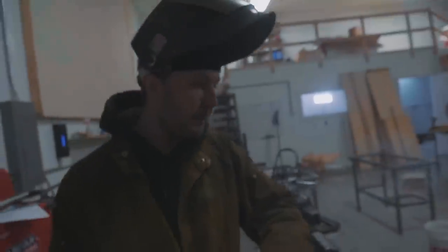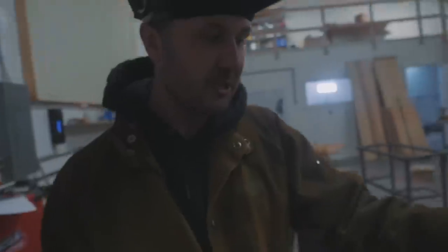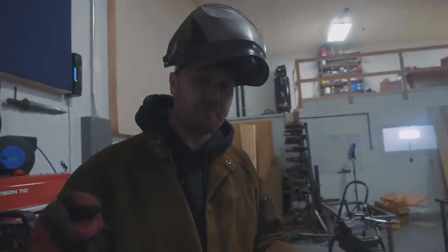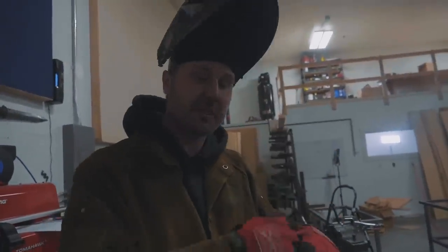There you go. Whoa, that's quiet. That is not sizzling bacon like I'm used to hearing. Yep, that's spray arc. And that was a quick weld as well. Super hot. That is beautiful, flat. Doesn't look like there's any undercut. Let it wet out and you just point and shoot. Adjust travel speed accordingly.